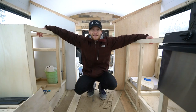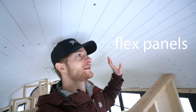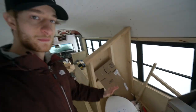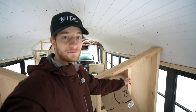It has been a little while since we've been out here. A lot of people run their wiring through the walls and ceiling — I'm not doing that. I will be using solar panels. That front part up top doesn't have a ceiling attached yet because of how I'm routing wiring. Under the bed is going to be my battery bank — that's where the electrical brain goes. I'll have 600 amp hours of battery, an inverter, and breakers all in that section. Some of it will be done from inside the back wall, which is why that end is still open.